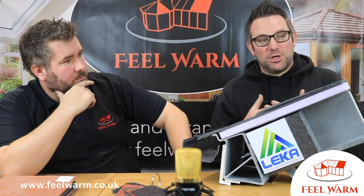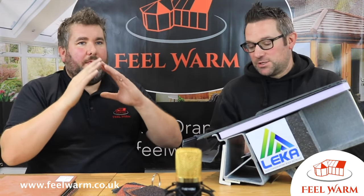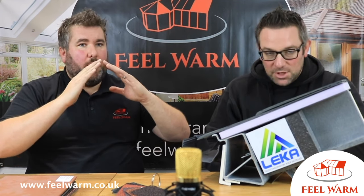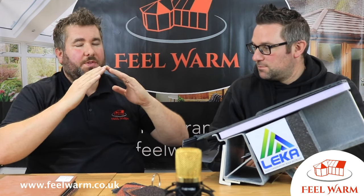But then people are lining these polycarbonate conservatories with the weight, and then they're not putting tie bars in. So what you find is your frames on the outside start to bend. So again, you're pushing it out. That's caused from spread, right? So yeah, if we've got our conservatory roof structure like that, the more weight that goes on it, the more it wants to do this, right?